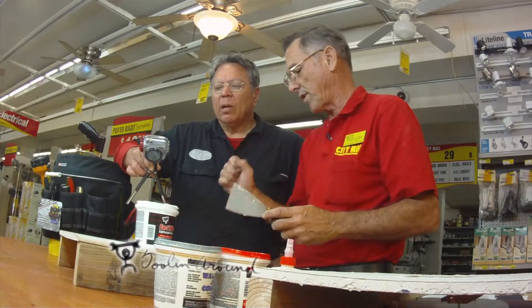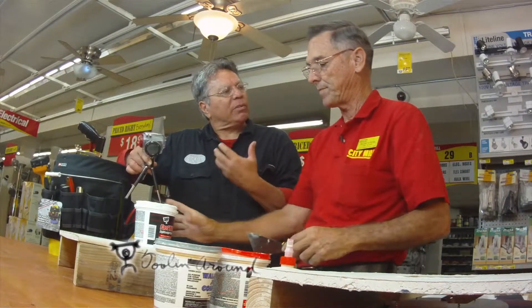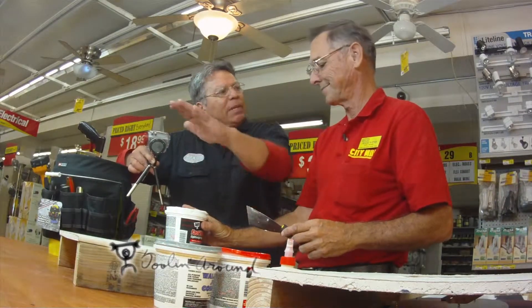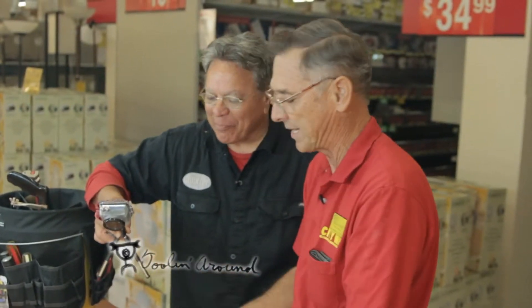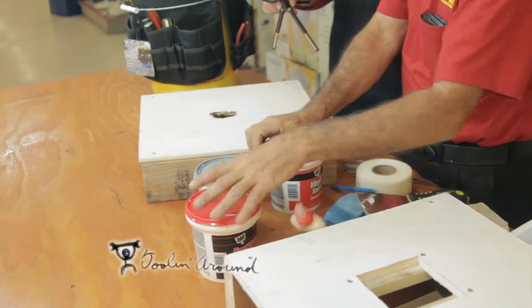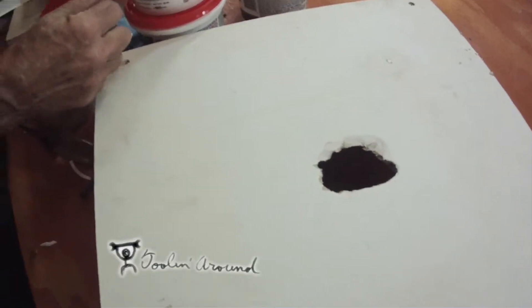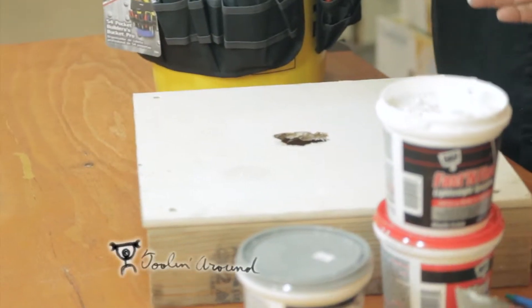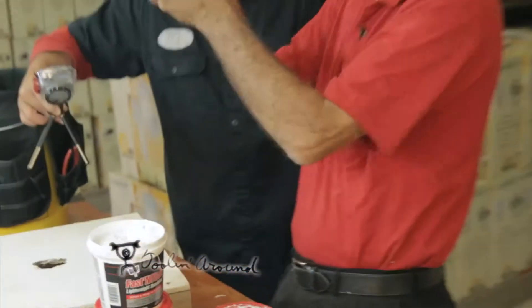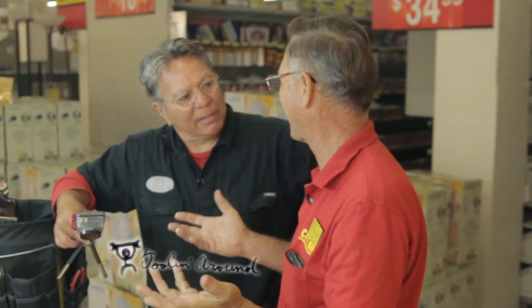When that hardens, it hardens like a rock. If you have wallpaper, you've got to find the same wallpaper and match it — so if you wallpaper your house, save some. For small holes, as long as there's a back you're fine. But when you have a hole like this, if you take spackling and try to fill it, it would just go right through. I've actually seen homeowners take newspaper, crumble it up, and shove it into their walls — not a good idea.